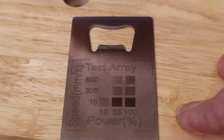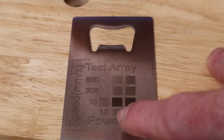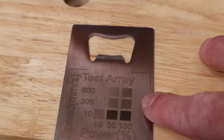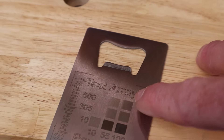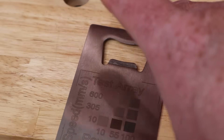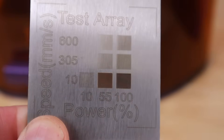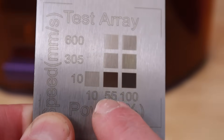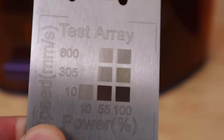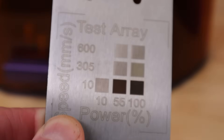The time is going to be somewhat relative to the size and what you need out of the engraving. If you want a lighter engraving that still marks pretty well, you have those options and can go a little bit faster. There's also a slight color variation — basically at half power it almost looks a little brownish, versus 100 percent power — so depending on what you want in your engraving, you have some options there, and you get a really readable mark.